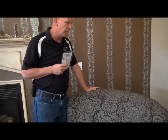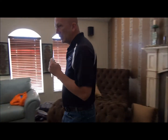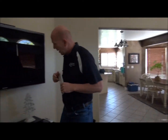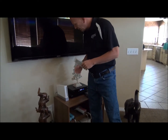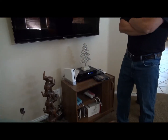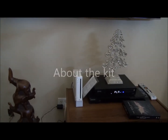A place like the top of this chair — that's three feet away from the wall and floor. It's great if you know the area is not going to be bothered; if it is, probably better off going with something like this. Alternatively, over to this side we've got a little desk here, and you can move a few things around and put the radon test kit about right there — perhaps less likely to be disturbed.